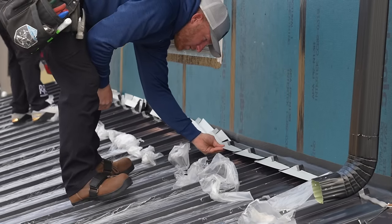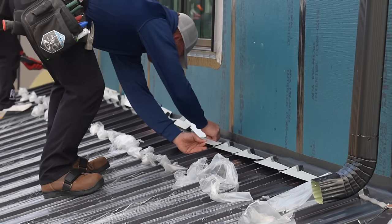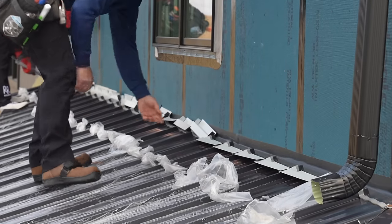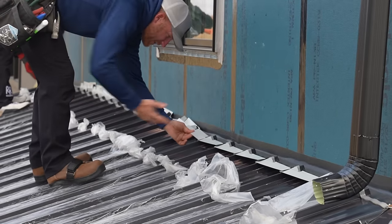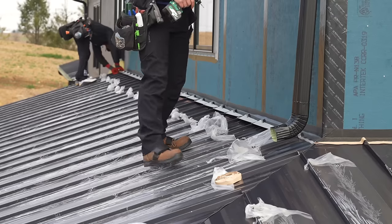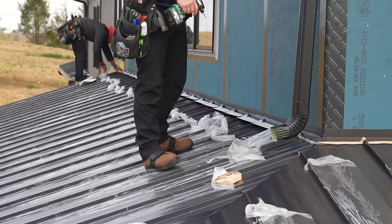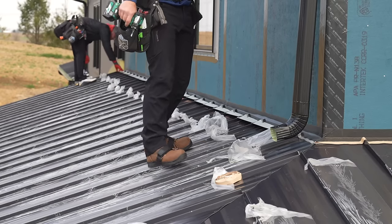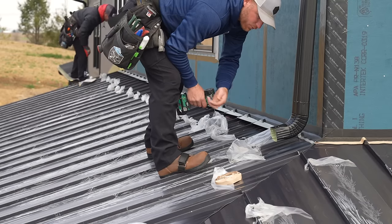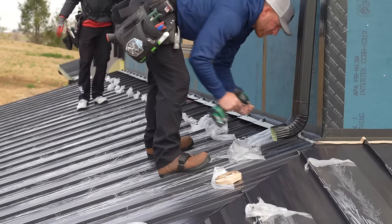You can see how these pieces go in — we just set them right into that double beaded butyl tape on our marks. That snap line is very important because we want to make sure our trim can lock onto this edge when it gets fastened down. Once these are set into the butyl where we want them, we're going to fasten them. This is also how the panel is going to be fastened on the roof — the panels were fastened through slots on the edges, giving movement, so something needs to fix the panel to the roof and allow it to expand and contract.